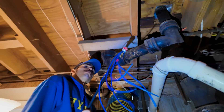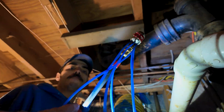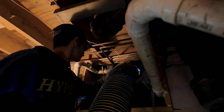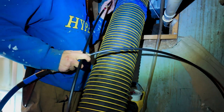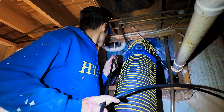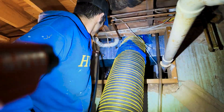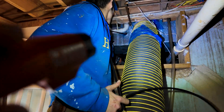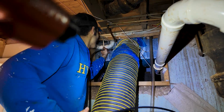You can see this ball right here — it's facing backwards, so he's doing a reverse pull, cleaning that insulation. Doing this can cause damage, which is why we encapsulate afterwards. That main line I was showing you in the duct work in the crawl space — that's it right there. Right now we're cleaning the main line. It tees off — one going left, one going right, one going up. We're using reverse whipping on the entire thing, going up and down, back and forth, getting all that debris and mold extracted out into the big truck outside.